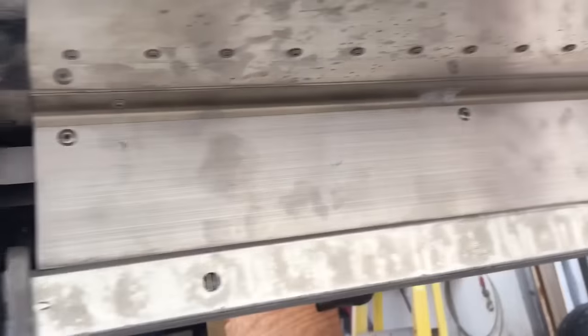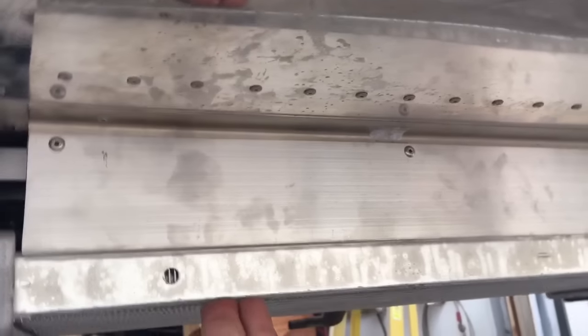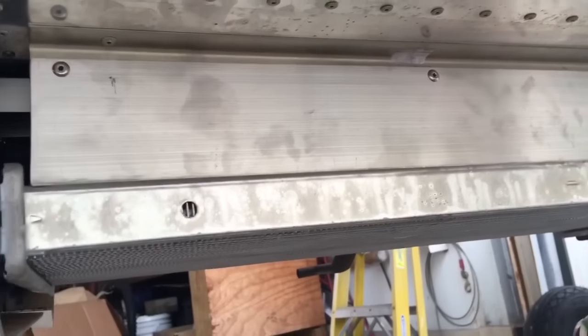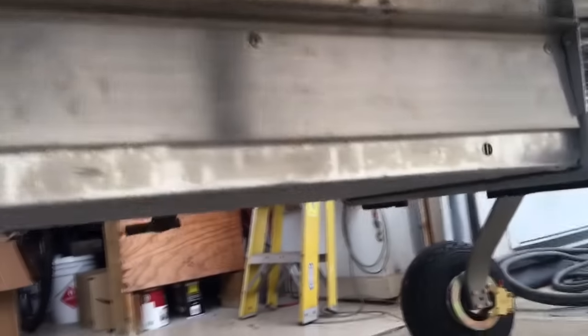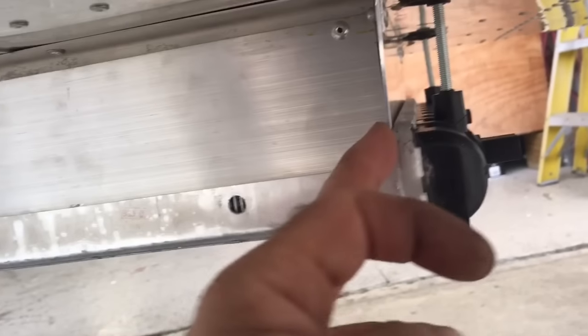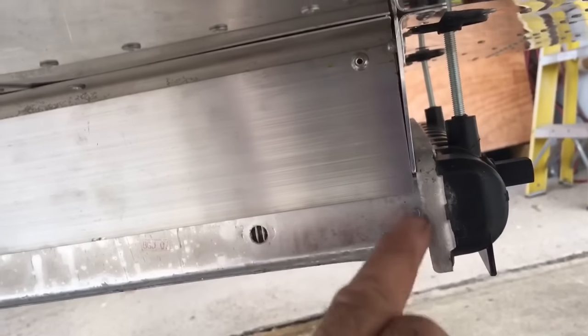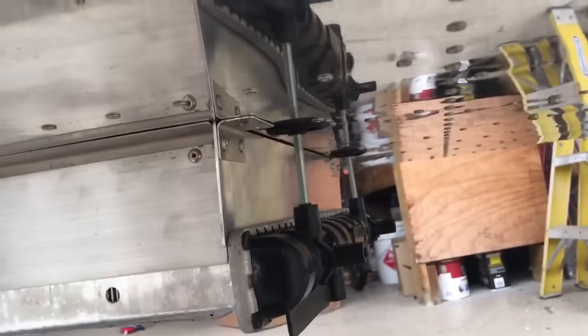All they do is close the air gap here so that the air stays inside the radiator. They kind of slide on the side so that the radiator can still bounce a little bit in the mounts and have the cushioning it should have. In the back, the piece of aluminum is made a little shorter so it doesn't rub down on the fins of the radiator, because we don't want to make a hole in anything.